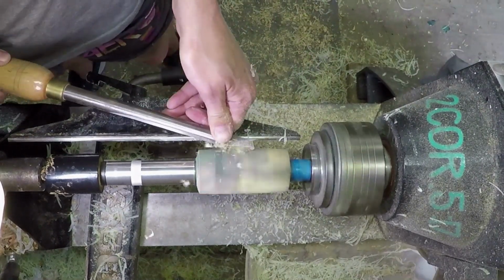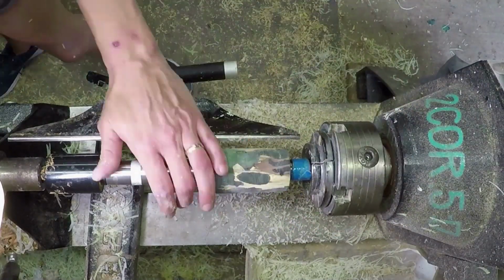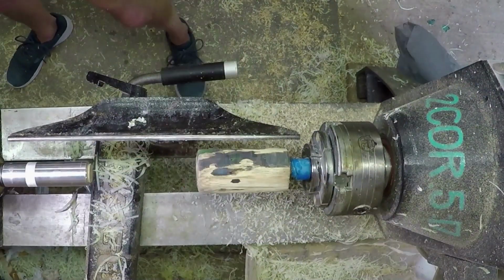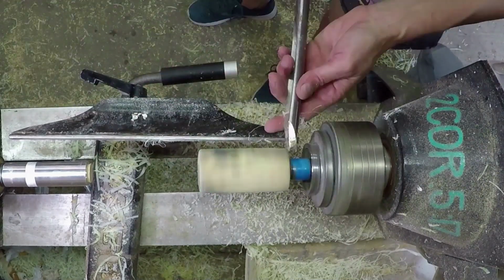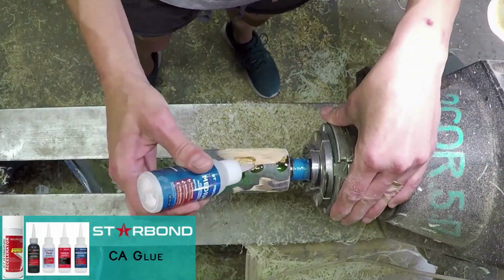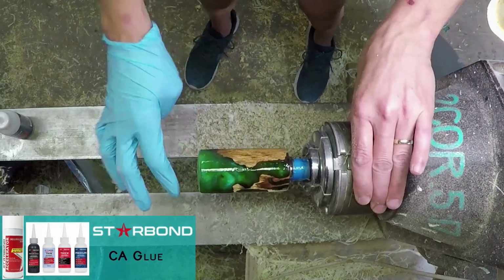The problem I felt is I should have left it sit in the acetone mixture at least overnight. The acetone won't gum up really bad on you until, I guess it all depends on how much acetone you mix in. So like I said, it's kind of an experiment. I should have left it sit in there longer so that way the wood can absorb a lot more, because I was still getting some tear out in some pieces.